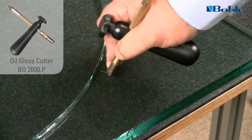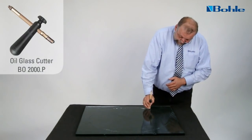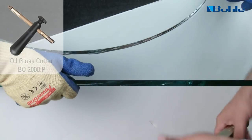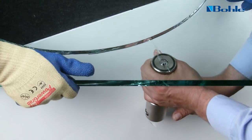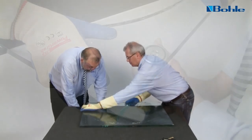Now make four auxiliary cuts. The cuts are made with the glass cutter and the freely rotating cutting head with a blunt cutting angle of 158 degrees. After that, the cuts can also be opened with the glass tapper using half the tapping force and in a central position.